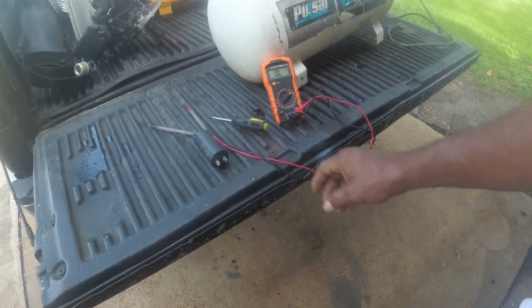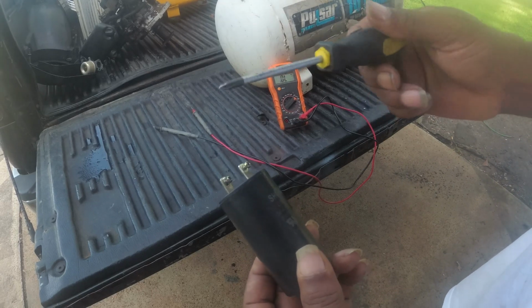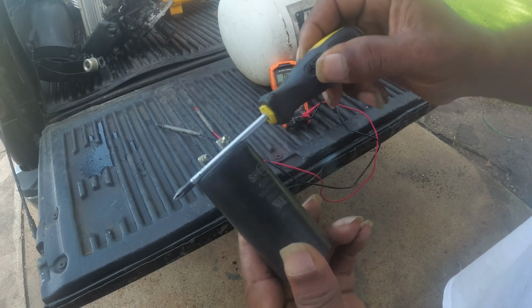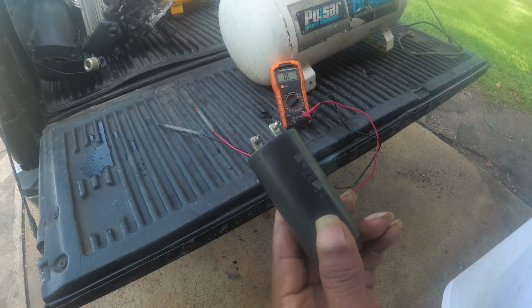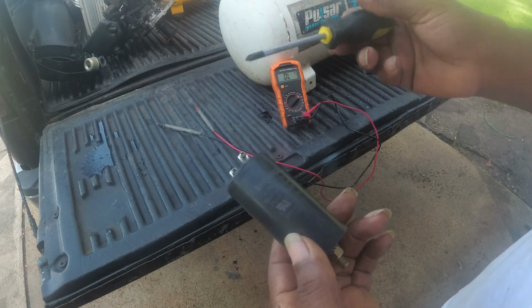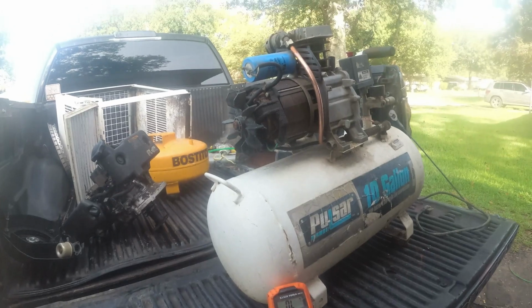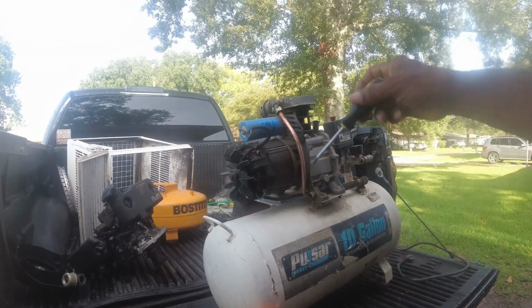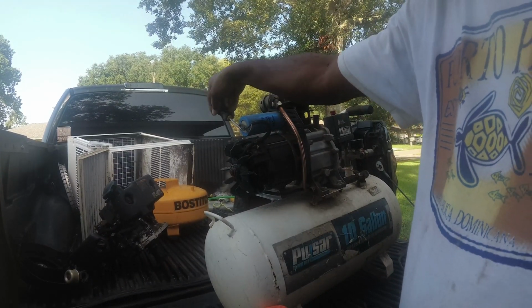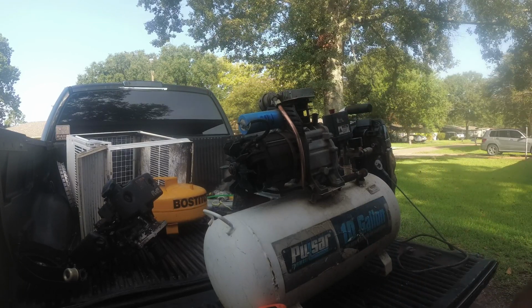Now, very, very important. Listen up to this one. Before you take something out, one of these capacitors, or put one in, take your screwdriver and touch them. For the simple fact, these hold a charge. And if you stand on concrete and you touch this without dissipating the charge, it can hurt you really seriously or kill you. So please, check it. I think I already checked this, but let's do it again. Okay? So we got that one checked again too.